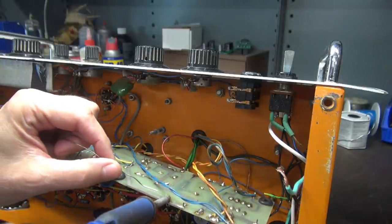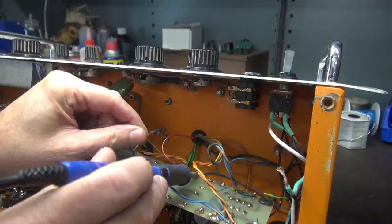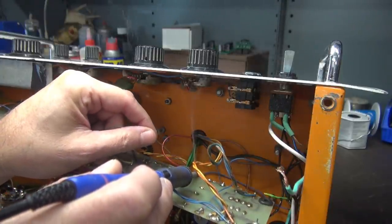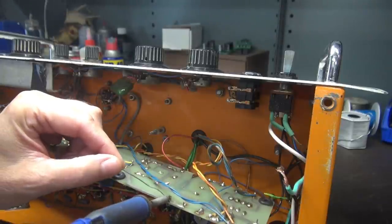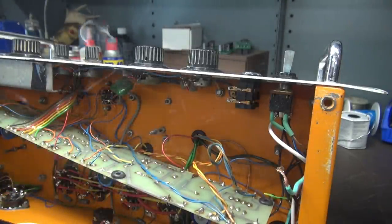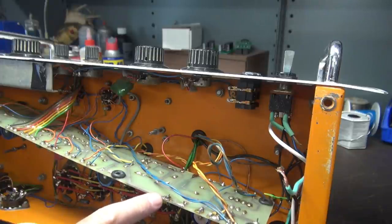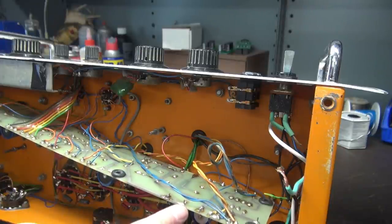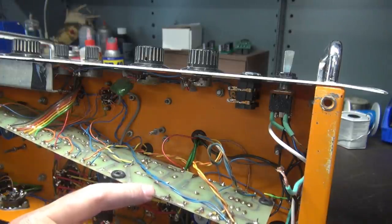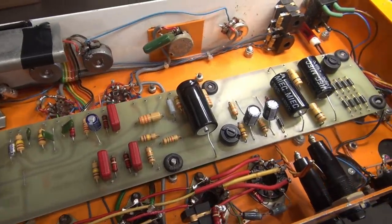The first new cap is in place — let's get them soldered up. I folded the leads over about a quarter of an inch to help with the connection. I like to fold the leads over rather than let them stand up, because these fatigue easier. This gets a better mechanical bite. I've got all the electrolytics replaced on the circuit board.